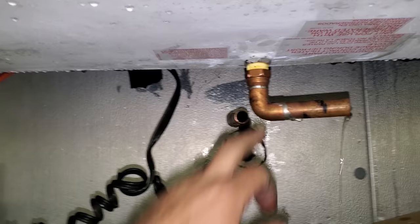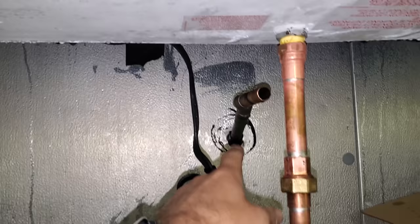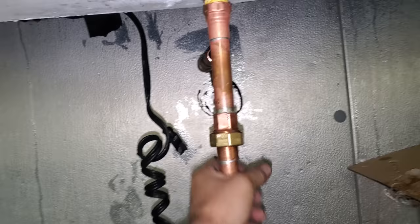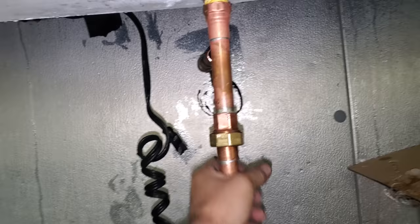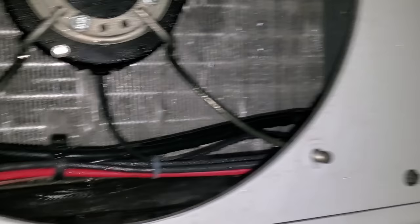I ended up finding a union and I'm going to put a water hose on this temporarily and drain it to the floor sink, then finish de-icing it. I made a chingus - found all the pieces and connected them, ran the drain to a hose, ran it outside. That way I can defrost this coil and get a good pitch on it to figure out where the short is. Before I couldn't put any water in the drain pan for more than five-second bursts - now it's instantly draining out and we're not plugging up at all.